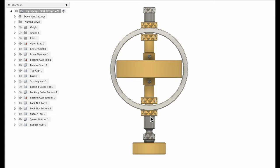So now I am going to use a single sized 3/16 shaft all the way through, no steps, no anything, no pressing it in place. So that simplified that aspect of it. And originally I was going to use locking collars with set screws on the top and bottom, but once I looked at how little space was remaining, I thought, you know what, I'm just going to put a solid spacer in there to take up all of that space.